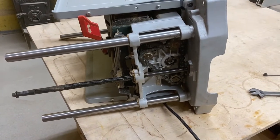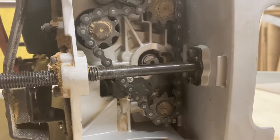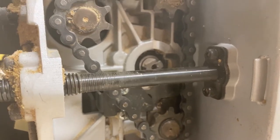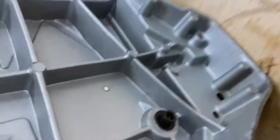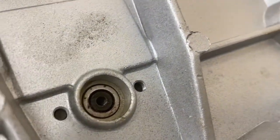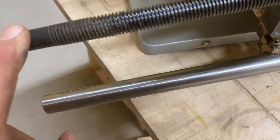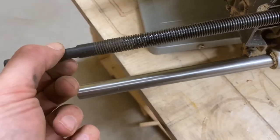So I flipped the machine a little bit on the side just to show you how to set your height calibration. As I said, you need to make sure these are fully bottomed out on all four corners. And then on your hoist mechanism, just enter it so it's snug tight. And when you fasten this little screw on the bearing, make sure you set a little wrench here so you don't start to turn this. Just make sure you hold it in the same position on both sides, and then it should be calibrated.